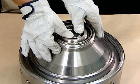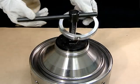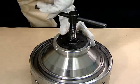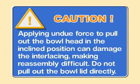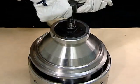Set the patch on the distributor, then set the push bolt, handle, bowl head jack, and disc nut. Gradually tighten the handle to remove the bowl head. The bottom of the bowl head is fitted with the main seal ring. Be careful not to damage the seal.